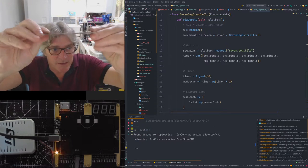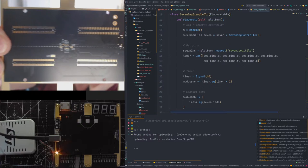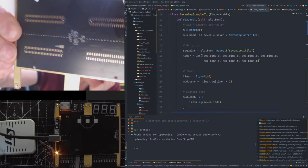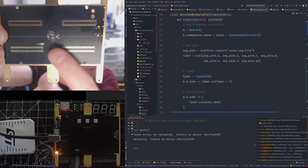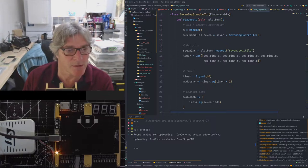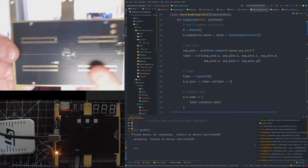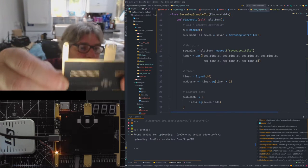And then there's the other side, because it's double-sided construction. So there's a few teeny tiny components, which are really decoupling caps underneath the BGA. They're unavoidable if you want decent operation. There's also a jumper for the programming voltage. That's just in case you want to program it with the permanent program voltage. Most people don't, but it's there if you want it. But more importantly, the tile connectors, one, two, three, and four.